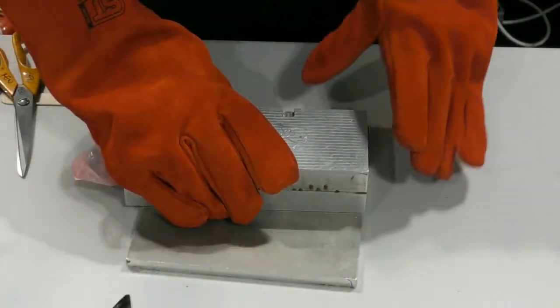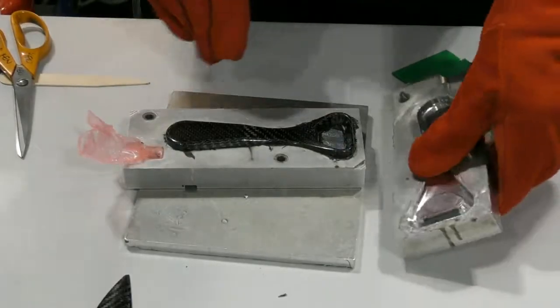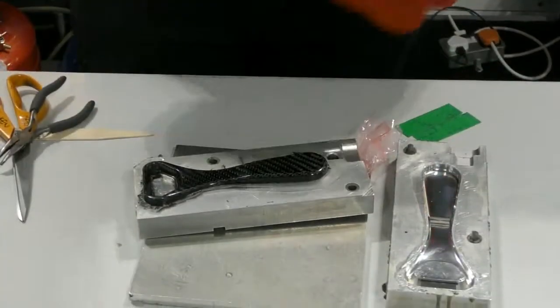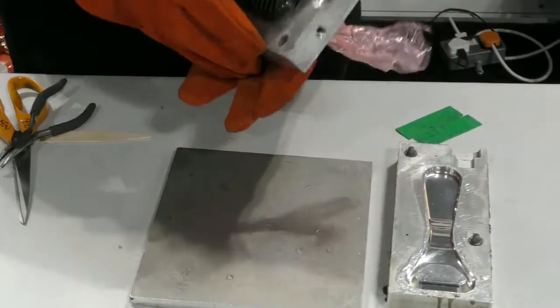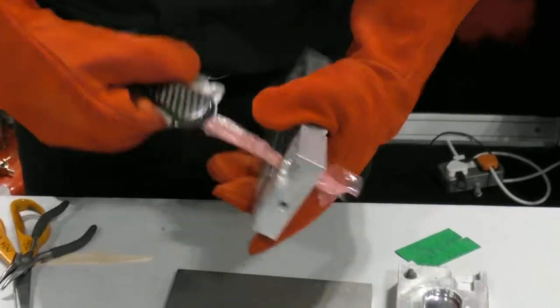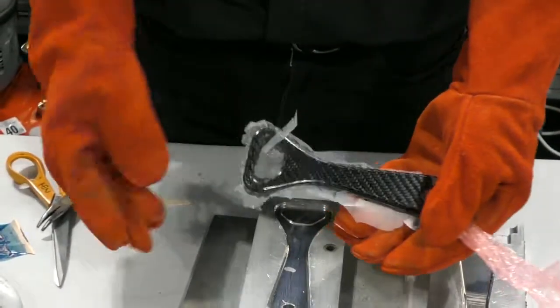It's fascinating. Over previous years we have undertaken manufacture of expanding cores, making little coasters, and people have been flocking to them. This year we decided to show something slightly different — a bladder moulding process. This year we are making little bottle openers, which people are just fascinated by. And they are flying off the shelf as fast as we can mould them.